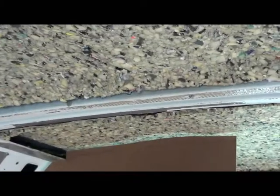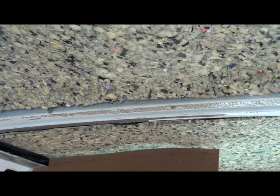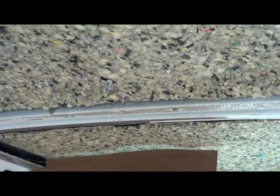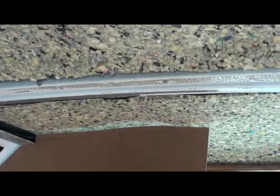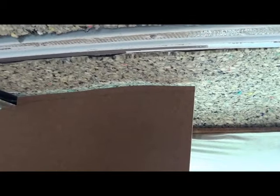Now you're wondering how maybe I'm going to steady this. Up at the top I'm going to take a steel bracket. I've got some scrap that's about 1/4 by an inch, and I'm just going to screw it into that. It's flat stock. Take it out to where the wall will be and bend it over so that it comes over the front of that piece of wood, not the back edge that we're looking at here, and run a bolt through it.